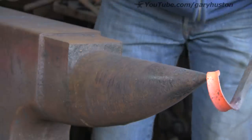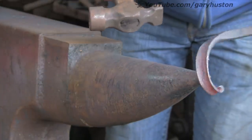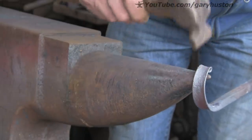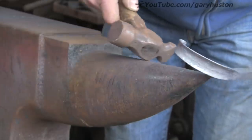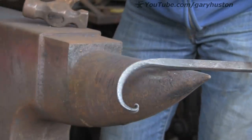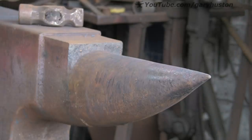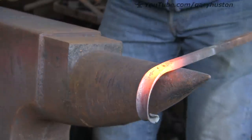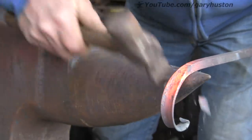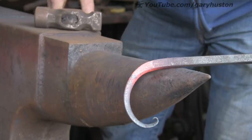So I'm going to do it again and this time not cool it out — just try and tease that very end round. Try and take that flat out. It's taken the flat out but it's made a bit of a bulge in the middle. This is actually quite thin so it doesn't need much hammering. That's not too bad, I've sort of got it out. I want to get it hot up the top there and get a bit more shape. Now that's a little bit thicker up there so you need a little bit more oomph — give it a bit more beans. That's not too bad. I think I'm probably going to leave it at that.